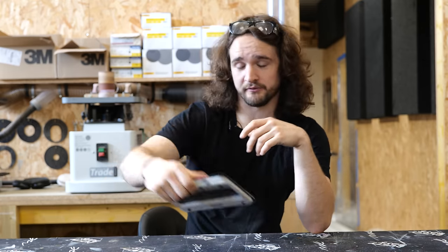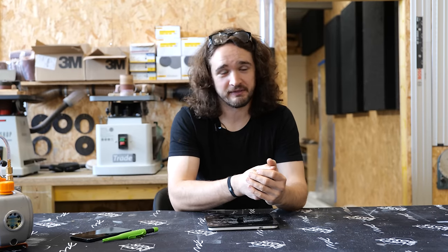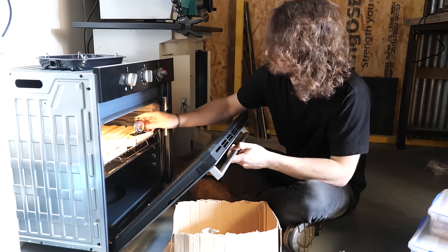The way we're going to do it is every hour or so, take five samples out of the oven and put them back on the scales, because when the water evaporates the blanks lose weight. When they stop losing weight, we know all the water's gone. I tend to be overly generous with the amount of time the blanks are in the oven — leaving them longer than needed isn't going to turn into an inferno, they'll just be very dry. With a full oven of blanks, even if I spend more on electricity, the amount of timber in there should make up for that deficit, and I can be absolutely certain they are bone dry and perfect for stabilizing.